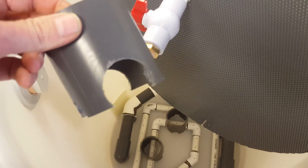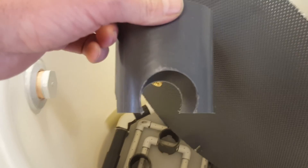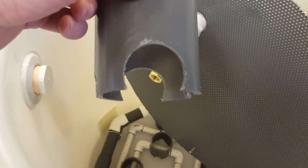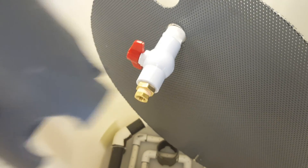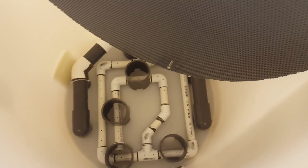I do have a fifth piece of PVC here to show you what I've done. I took my hole saw and drilled holes in the bottom edges of this for two reasons: one, to go over top of the three-quarter-inch pipe, and the other to allow the muck and the waste to move freely underneath, especially when the air is being purged in the system.